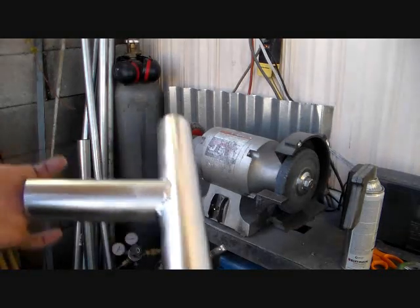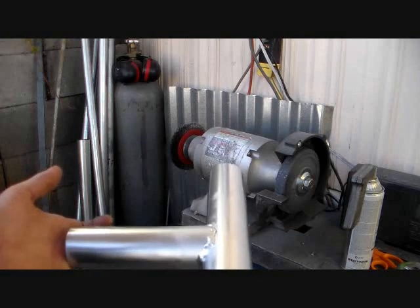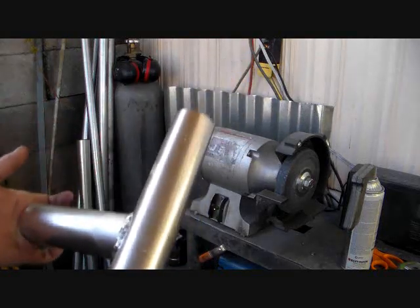And this is the same thing if you want to make weights for it, or you want to make a can weight to keep it on the ground. You're going to use the 1 7/8 line post for chain link fence as a sleeve for the 1.5. Or if you need to make a butt connector of any kind.